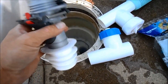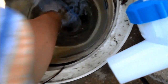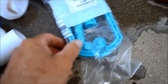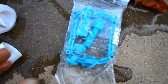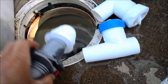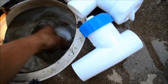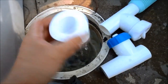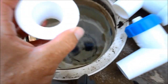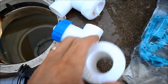If your cleaner is hooked up in the skimmer, it may pop out, which is very common — you'll see it floating with the hose. You may need a locking bar to hold it in. You can also make sure when you install it in the skimmer you have the proper adapter. Most cleaners come with this adapter, which goes in the hole in the skimmer and seals it so the various skimmer adapters will actually work effectively.